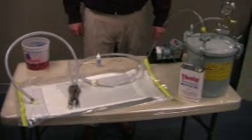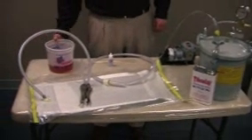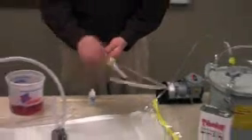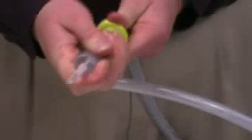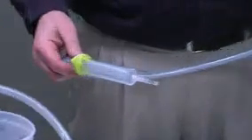Now that we have full vacuum we prepare our resin. In this case infusion resin — Orca 100, 150 centipoise resin. One more piece that you may need is an emergency repair kit. What I've done is wrap the tube with bag tape and I have a syringe. I place the tube and seal it in place. If there's ever an uncured section you can either hook it up to vacuum or resin and inject a certain area that you're trying to repair. In this case with the panel we probably won't need this, but on larger parts you will.